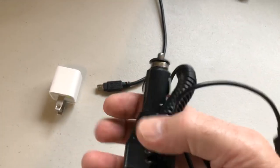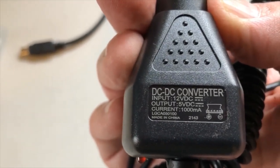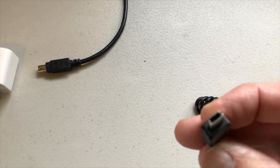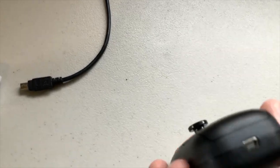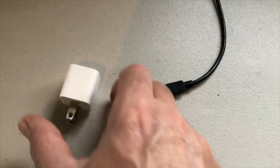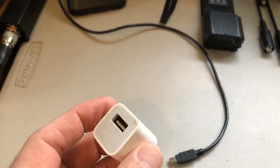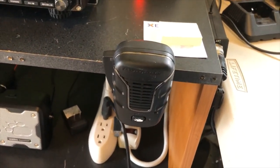I did want to use the 12-volt charger. If you read the specs, this takes input 12 volts DC and outputs 5 volts DC, and it uses a mini USB to connect to the bottom of your speaker microphone. What I did was attach another cable to one of my old Apple iPhone chargers — it's a 5-volt charger, just like the car charger. So I have it running over to my radio and I can plug it in there and charge it at night when I'm done using it.